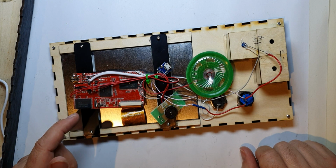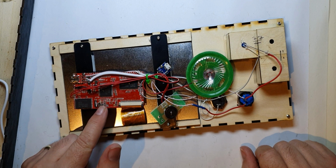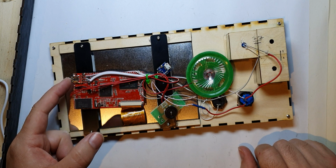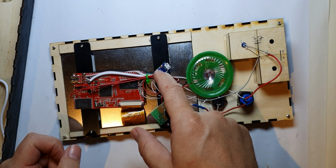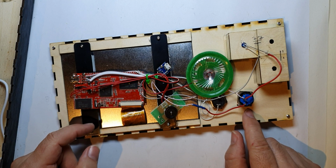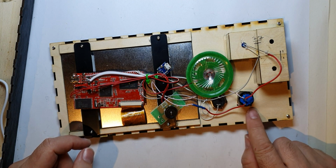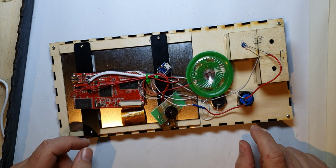I've put the data in as well because that would be useful, because then I can update it without cracking the box open. I've still got access to that, that still works, but the power lead from that I break as it comes in and send it to this switch there. This board and the USB doesn't light until it's turned on, and in the same way I can't do a data transfer unless that's turned on, because that bit there just breaks that input.